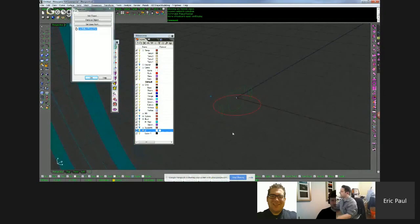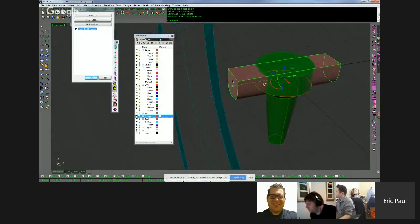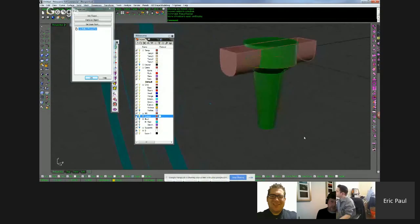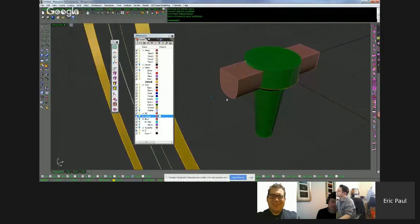That gem rail comes in handy. These are profile cutters. So when I'm doing a thread cut stone, bead set stone, this is going to cut my center channel. This is going to cut the outside to give me a channel going down the side of the stone. And if I turn on my cutters layer, this is going to cut from the side of the shank to the side of the shank, and that's going to give me my pilot hole down to the bottom. So all of these are in this block definition.